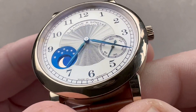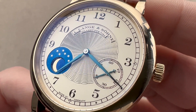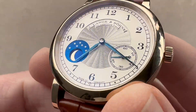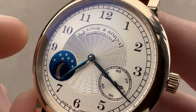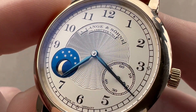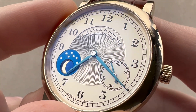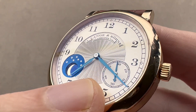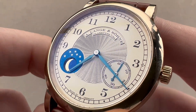It's uncommon to find a watch with only a moon phase that uses that long-duration moon phase design. The dial, although silvered white, is a solid disk of gold. The dial center is cut with a rose lathe to create a rosette pattern — a solid gold engine-turned dial. It is an 1815 because it features Arabic numerals with a railroad track outboard against which to read the minutes. The hands, including alpha hands at center, have been fired blue.